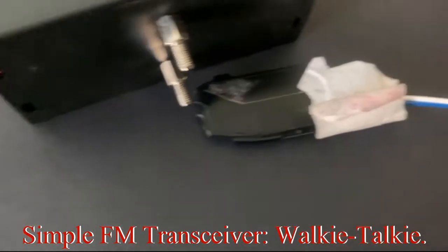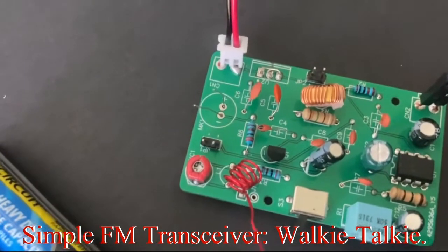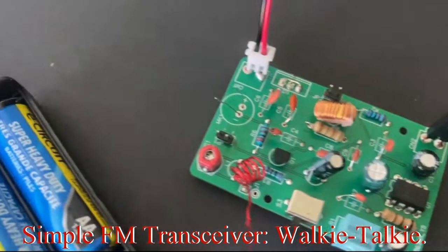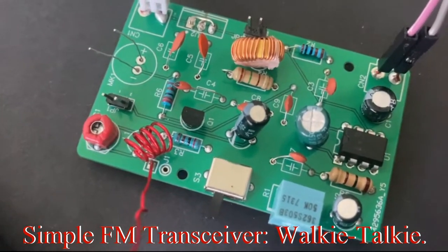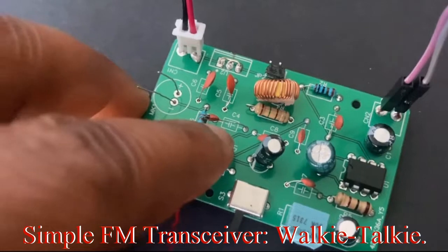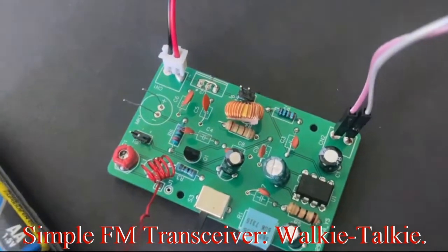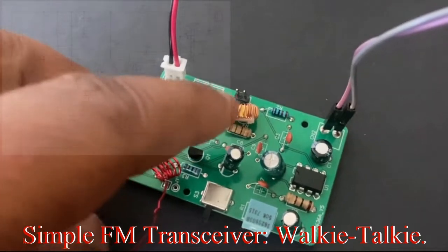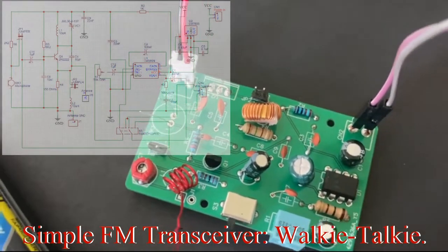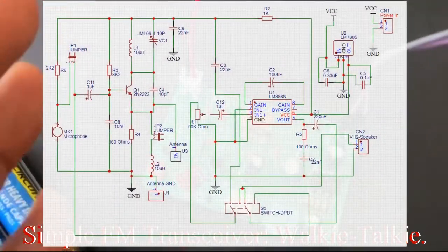About the reception, we have no issue with that. The problem we have is amplification. I would advise putting a pre-amplifier before this amplifier. In my case, I just went from one transistor to the amplifier and the signal is very weak. You need a pre-amplifier stage before that. When you build this, add at least one or two transistors — I would advise you add a two-transistor stage before the power amplifier. That way, if it's too loud, you can remove one of the pre-amplifiers; if it's not loud enough, you can leave them in. I'm going to try a different speaker now and see how it improves.